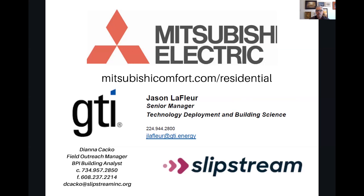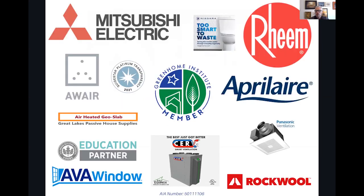But now what we've seen here recently is a big change in what we're allowed to have. So if I was in a situation where I had a dual fuel system, and now I have the ability to purchase almost all of my electricity as renewable, I would change that. I would move mostly to my heat pump and use only a small amount of gas, just because of how fast the grid has changed in the last couple of years, even in Virginia. So you do have that option.